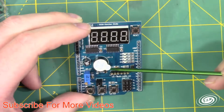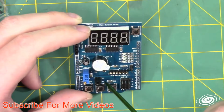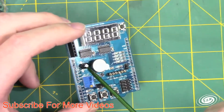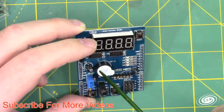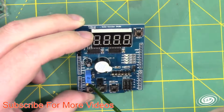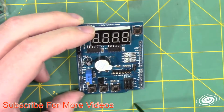And then there is a buzzer here. I believe it's an active buzzer, and it has a transistor to drive the buzzer. It has a resistor, and I'm not sure if this capacitor is across. It looks like this capacitor is across that buzzer as well. And then you have a variable resistor, a 10-turn trim pot, on A0. So you have all your analog pins taken up.